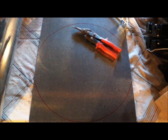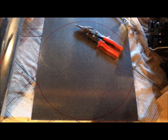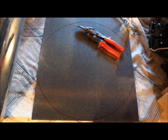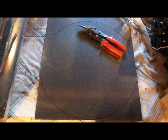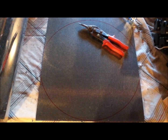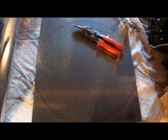The lip of the pan was slightly bigger than 16 inches, so I just let it go off the edge a little bit. When you have tin snips they will cut to either the left or the right or straight. I'm right-handed so I'm using tin snips for the right hand that cut to the left, so we'll be cutting this out next.